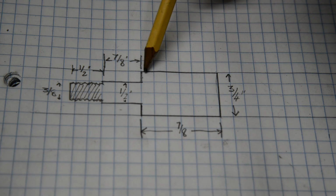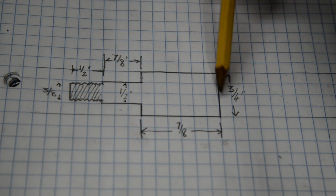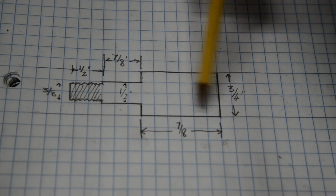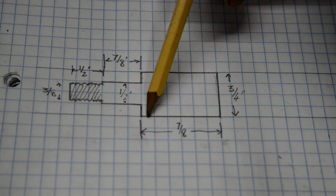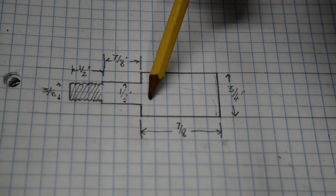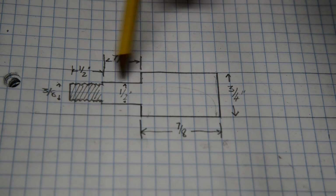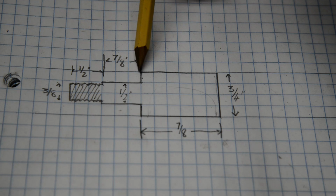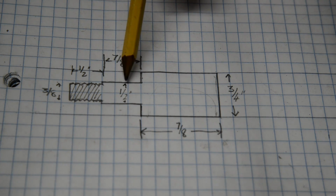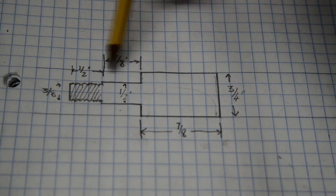So this is the part that is in the frame. Okay, it's 3/4 diameter. I've made it 7/8 so that I have just a little bit when the tube is coped on. I'm going to have just that 16th of an inch at each side. Then this is where the rear suspension unit will go. So here we go down to 1/2 inch, because I'm getting both eyes, top and bottom, on the suspension units made to 1/2 inch. That is 7/8 long.